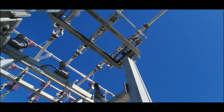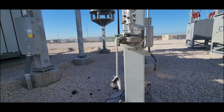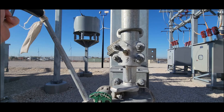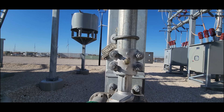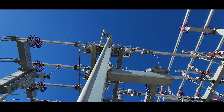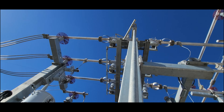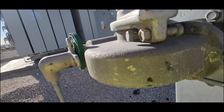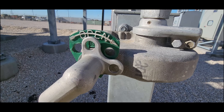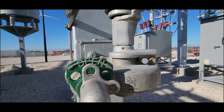We didn't talk about the low side main switch. This is a hand crank — it's not a motor-operated disconnect; it's a hand-operated one. That's fairly normal for the low side voltages. We have to mount the nameplate still on it. So it's closed now; we'll open it. To open it, you twist this and you can see the axle slowly turning. We need the nameplates on these to show open and close. As we're turning it, the linkage is lifting up the bus. When it opens — which is open now — we should have a stop here. That stop still needs to be adjusted because it's supposed to hit right here. Conversely, when you close it, you want it to hit as well. So we need to adjust that and get those open and close signs up here.